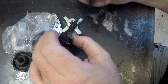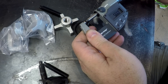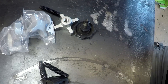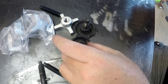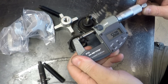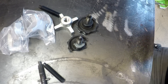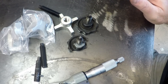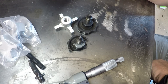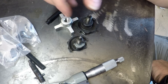So I need to turn these down to this diameter and to this length — 5.4 millimeters. Somewhere in there, not a critical fit. We're going to put a collet chuck in and chuck up on these, then turn this down and turn this to length real quick.